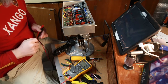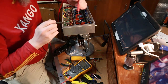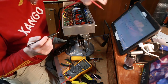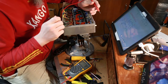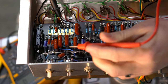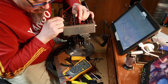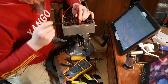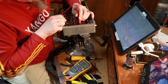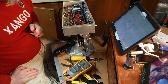I'm not gonna show you all of it, but you'll see I'm just going to carefully continue that process by looking at what each next component will be. For example, the anode of this one is 270K, so I can measure that. I'll put it back to resistance mode — 267K, yep, so it's perfect. I'm just gonna go through that process; I don't need you guys watching with me the whole time.